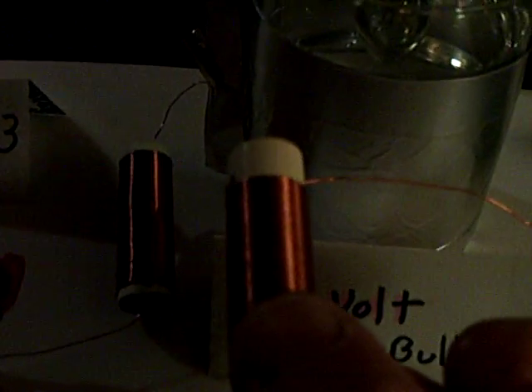I got rid of the coil that was down here, doctor, that you said might be making a magnetic link between the two exciters. So I took that off and just went to your one-wire setup like you showed in your video. I don't have a ground wire on this anymore — it's just a one wire feeding into the second SEC. I bumped the voltage up to 24 volts like you showed, and it's a little dark in this video because I wanted to show the effect in the glass. Same thing on this side — I've got 24 volts on this side with the SEC 15-3.